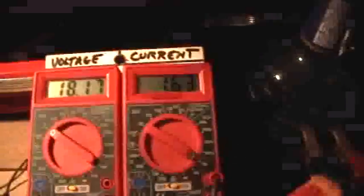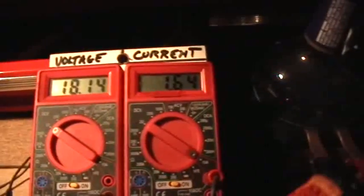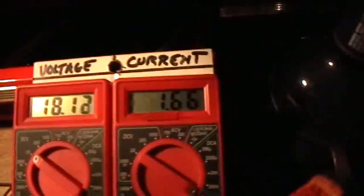You can see that the oscillation voltage of the ring oscillator goes up, and at the maximum output voltage I get to that — but that's really too fast. See that negative current excursion there? So we'll turn the voltage down a little bit, back down to about six volts or so. Six volts gives a reasonable flash rate on the ring oscillator.